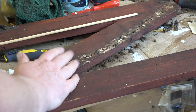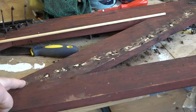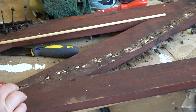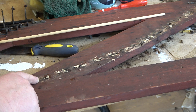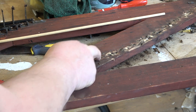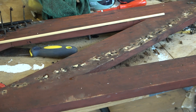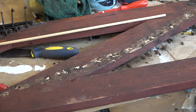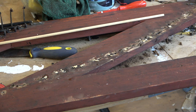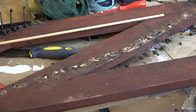So I did the first 12. There are more. These are fine up to there, but once I've filled in the worst ones, I can see some others that aren't quite as bad. So I need to fill those too — probably about 14 in total. Because we are putting in bigger screws than came out: the original screws were about half-inch number fours, and we're putting in five-eighths inch number sixes. Everything's slow because the glue has to dry 24 hours — it's got to be done right.